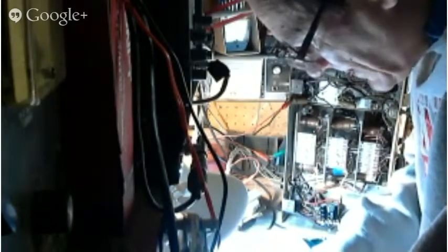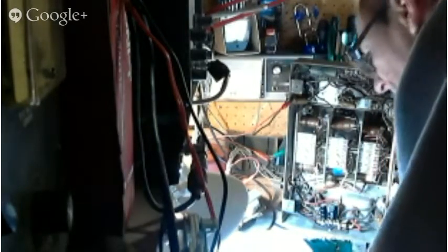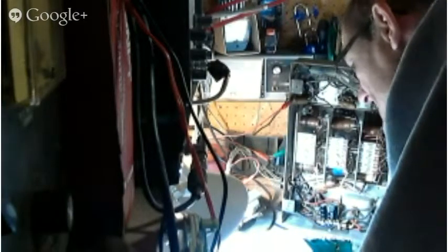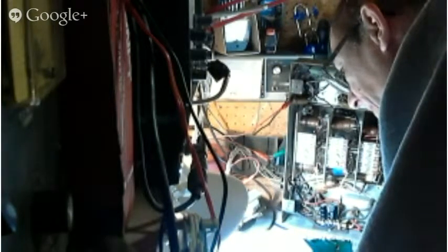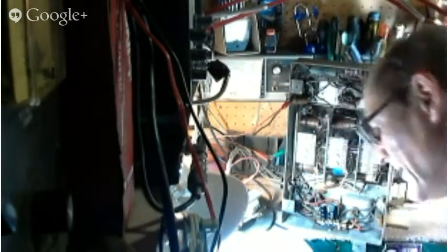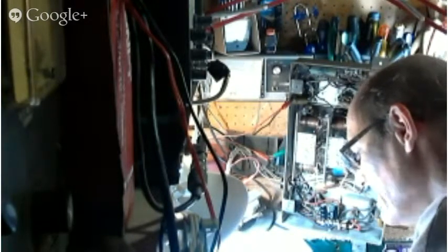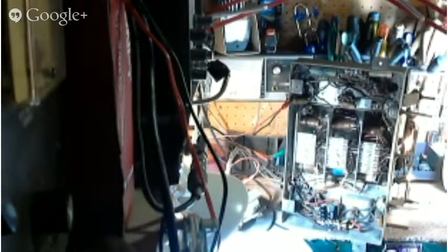Now broadcast oscillator trimmer. Turn the pointer to 1500 in the broadcast band. Feed a 1500 signal through the antenna terminal, and on the service oscillator adjust trimmer C2C. Okay, it's C2C. C3. C2A. Oh boy. There's C2C. It's right on the top of the set.